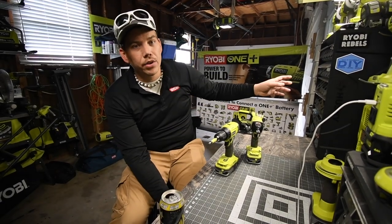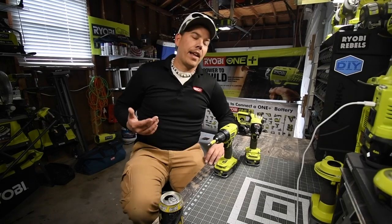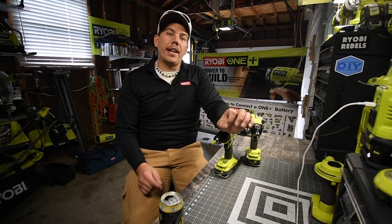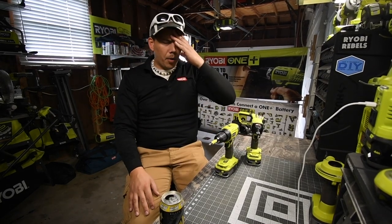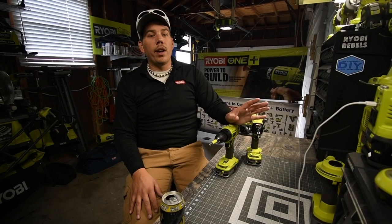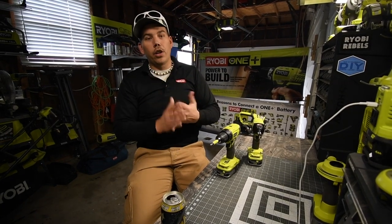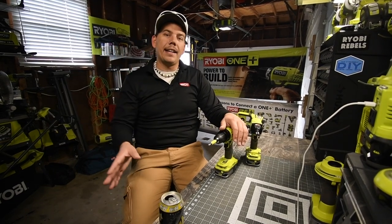In future videos we're going to go through the entire house. Some of the vents lead to nothing — they're just old exhaust vents, because this house was built in the 60s with no HVAC system at all. What we need to do soon is go underneath the house into the crawl space and put insulation through all the beams, to prevent cool air from the crawl space coming through the floor. I'll be getting the One Plus stapler for that, and we'll insulate all the pipes and cover all the useless vents to prevent heat from escaping.